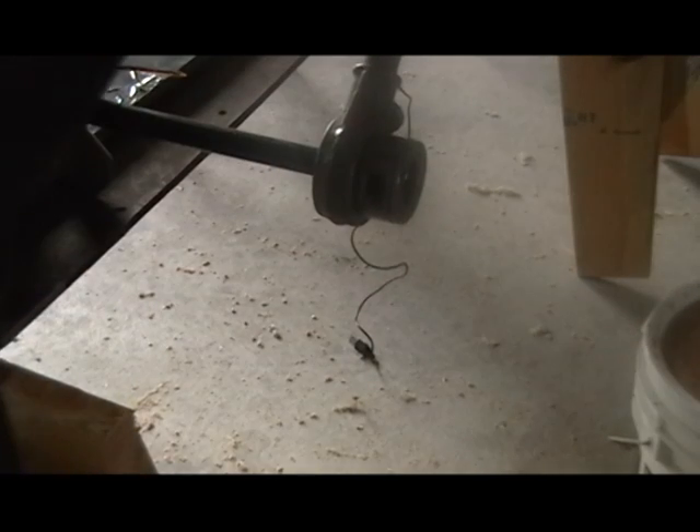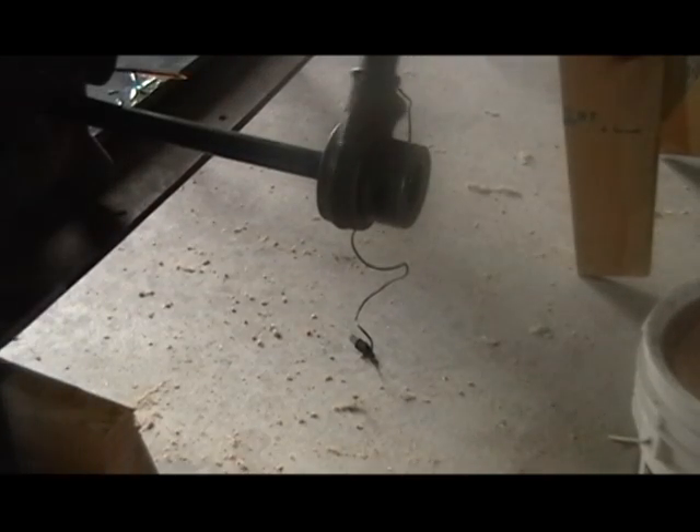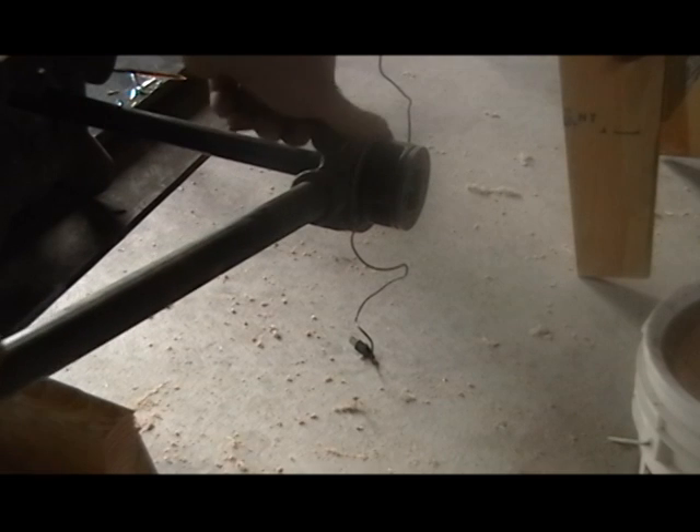We have too much metal stuck in the threads — that's bad. Loosen it back up, back it up until it's loose, and you'll see a bunch of metal shavings fall out. Those are your cuts. That's pretty loose — let's tighten it back up again.